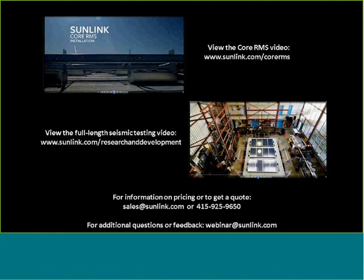Thanks a lot, Ian. Lots of good questions filtering through. Someone asked if the systems that were seismic tested were ballasted or connected, and those were in fact all ballasted systems. So we totally understand that every jurisdiction is different, and some aren't going to allow ballasted systems at all. But for those that are, we are able to provide a ballasted solution under seismic loads.